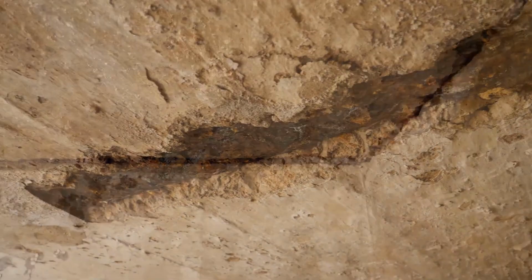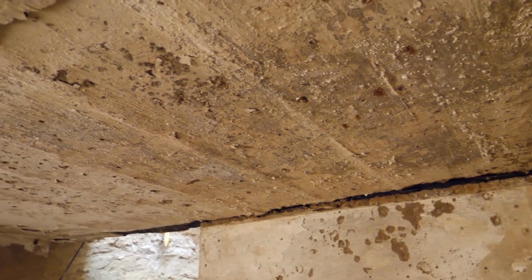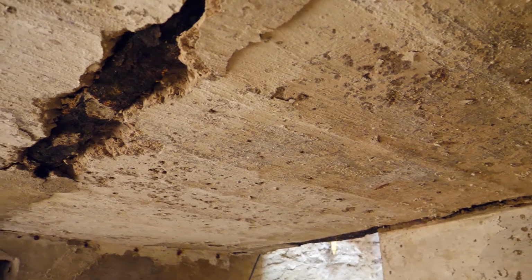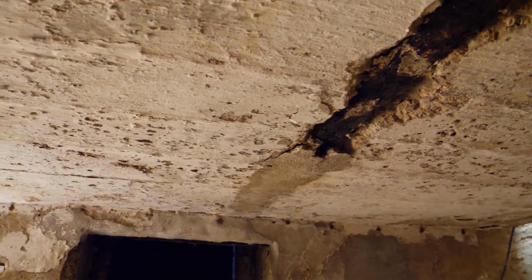Armed with a hammer and chisel, I will remove the stone segments between the steel beams piece by piece, and thus remove the old basement ceiling. I hope that I can make progress with a hammer and chisel and do not need heavy equipment. I will take you along with me. Stay tuned to see how it will all look in the end.